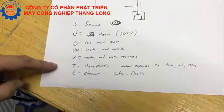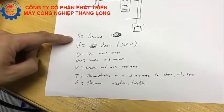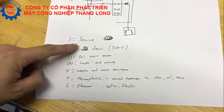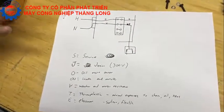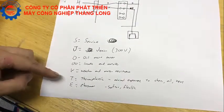I got all the different letter designations for service cord, also known as portable cord. Everyone's going to have service junior. You can get regular service cord without the J — it just means it's rated for higher voltage. Junior means up to 300 volts, which is what we're using here.